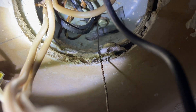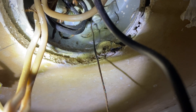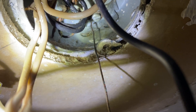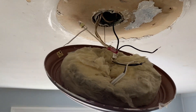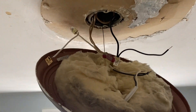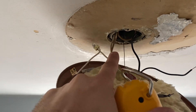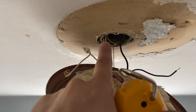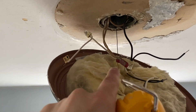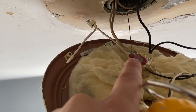I'm going to show you what that looks like on the ground screw — you can see it's a flat head in there and you just wrap the wire around it. There are two wires on there; just make sure it's on tight so that when you tighten it down the light can actually hang on it. Now that it's hanging there, you can see there are two white wires — in some cases there'll just be one white wire coming down and one black.